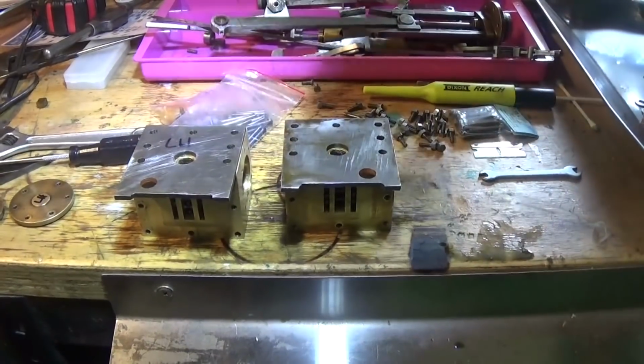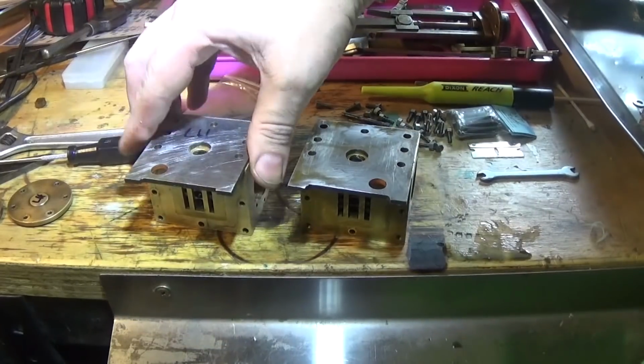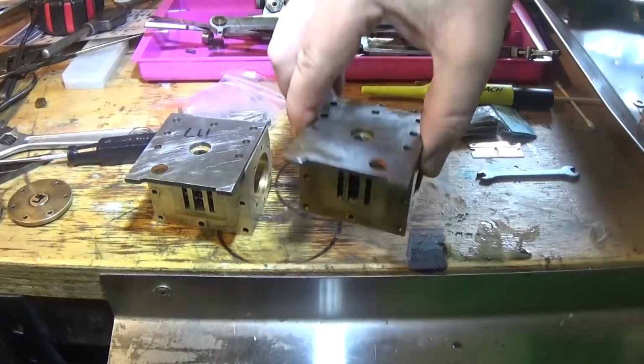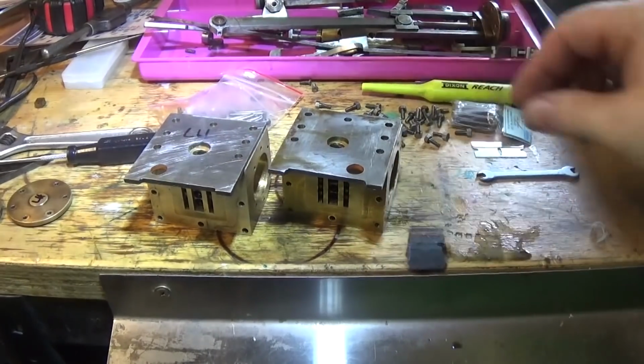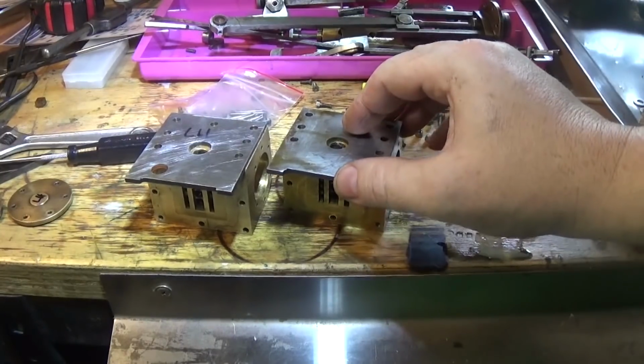So these cylinders have had a bit of a clean up. They're nice and square, and all the holes are nice and square. The covers aren't interchangeable. I believe that they've probably all got 1/8 Whitworth bolts in them, rather than 5BA like the drawing says. But that's not a huge deal. Up to not so very long ago when the internet happened, getting BA bolts and the correct materials for the job was a little bit difficult, and you sort of did what you could. And I understand that, and we'll live with it.